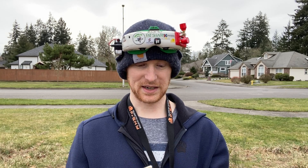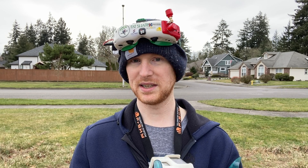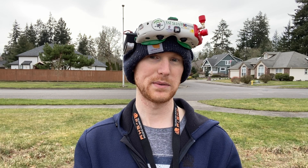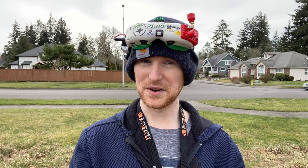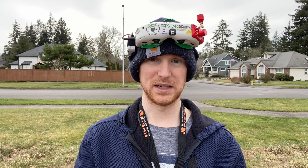I'm going to wrap this one up. That was really fun — I love designing stuff and tweaking it to get it to work. I did not foresee the vibration issue; I thought I could just print it and go with pretty much the same design I'd used before. But because I switched from PLA to PETG — which is less stiff — I had some of these issues. I was eventually able to get it working by increasing filtering and adding stiffener bars. If you haven't done this before, I recommend it at least once — you learn a ton. Please drop a like, leave a comment, and subscribe. See you in the next one.